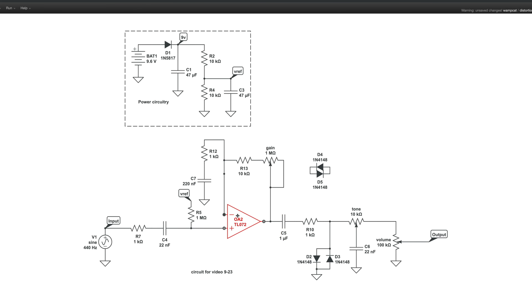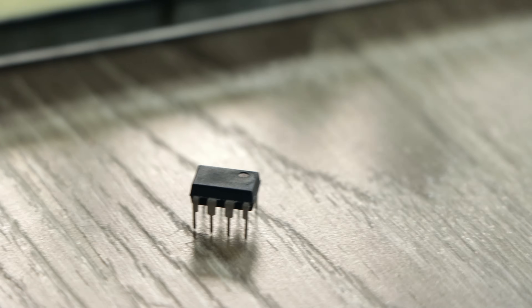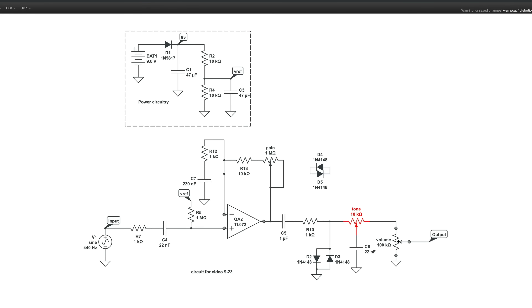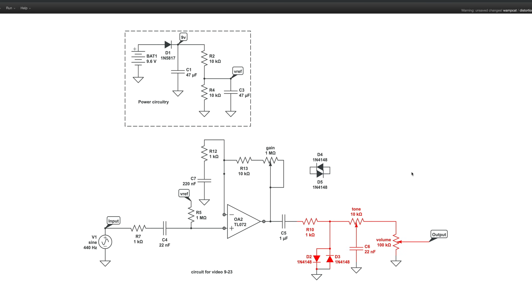So from there, we go out of this op amp - that little triangle is the op amp chip. We go out through a capacitor, then through a resistor, and the diodes are clipping to ground - that's a hard clipping arrangement. Very simple tone control just rolls off some highs or doesn't, depending on how you have it set. It's a passive low-pass filter, basically. Pretty simple - into very simple tone and volume control. I should also mention I do have a buffer in front and a buffer behind - our DBplus pedal - just making sure that running long cable lengths I don't get degradation of the signal, because with all this you're going to have a higher impedance.